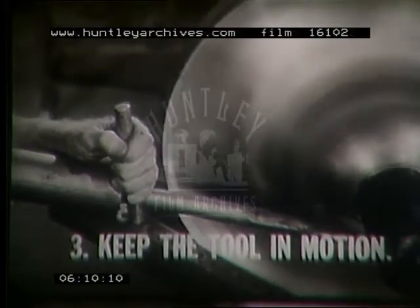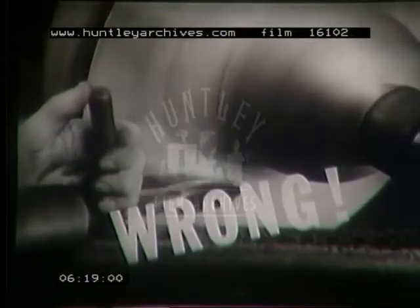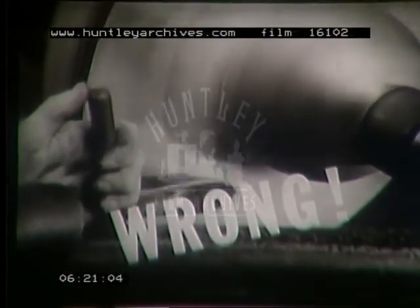3. Keep the tool in motion. If it is left in one place too long, it will cut a ring or groove in the surface. But if the tool is moved too fast in relation to the speed of the machine, ridges will result.